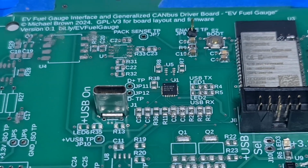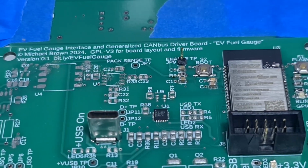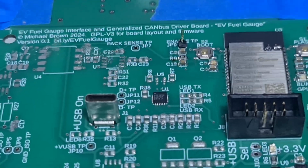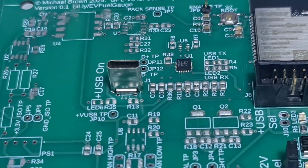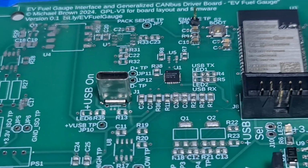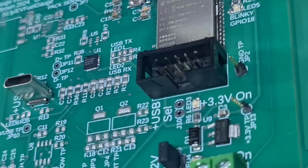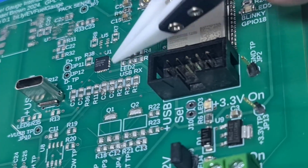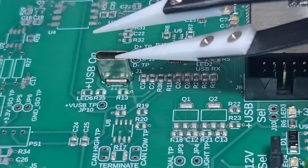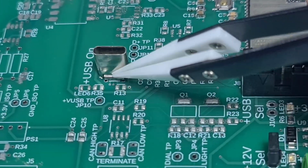Well, it didn't go horrible. I mean, the problem with this little plate is I was pushing the button on the time, but it wasn't able to keep up. So I ended up way behind the curve, yada, yada, yada. But I held it at the peak for the amount of time it asked for and then dropped it down slowly. The UART chip actually looks good on 3 sides, but this side has a couple of solder bridges that I can hopefully fix by hand. The USB-C connector is a big question mark because the pins, I can't physically see the pins.